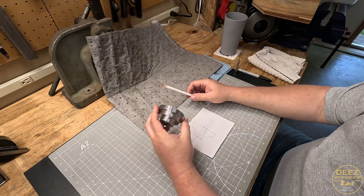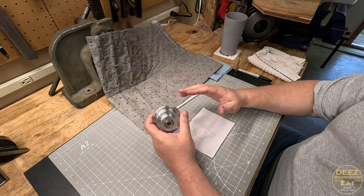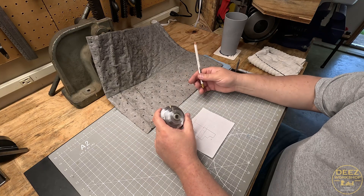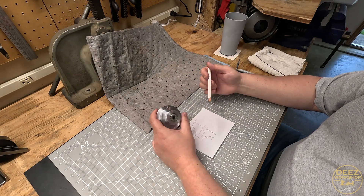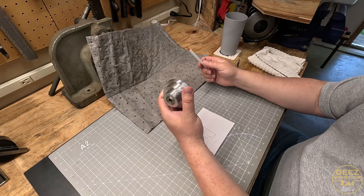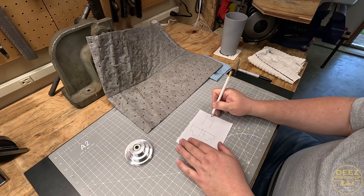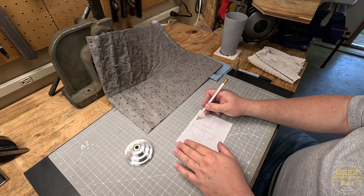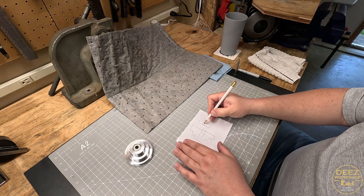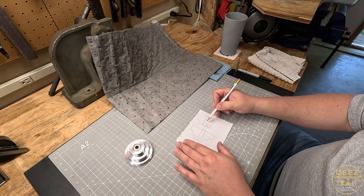The redesign that Dave came up with, as we collaborated back and forth, and I should also say there were tons of great suggestions in these videos from everybody watching — the experts out there. All of you had a hand in this final design and the ideas that we came up with. A few of you are just experts in this and you probably already knew what the problem was. So the new design is: we take the bore inside the pulley, and what we did was we press fit a bearing here and here — so here's one bearing, and then we press fit a bearing back here. And in between is an aluminum spacer.